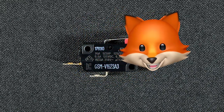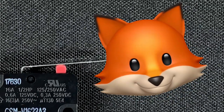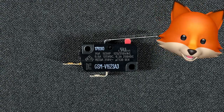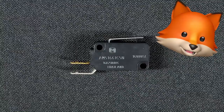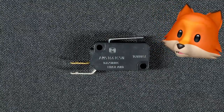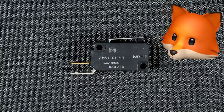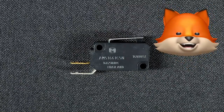Without further ado, we will need a Gursung A3 switch — we're going to be taking the spring out of this guy. These are the soft AM5s; they have approximately a 120 gram spring in there. So what we're going to do is swap out that spring with the 180 gram spring from our Gursung switch. You can currently get these on the Focus Attack website; the link will be in the description box below.